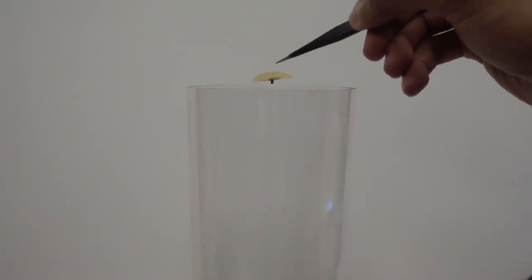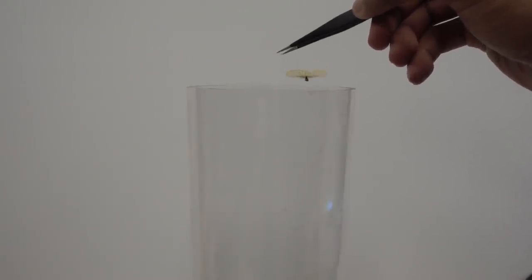We take inspiration from these dandelion seeds to build battery-free wireless sensors that can fly in the wind. Here we see one of these sensors hovering over a vertical wind tunnel. While some seeds flip repeatedly as they fall, dandelion seeds always fall in the same orientation. We emulate this structure to allow our sensors to flip over and slowly fall to the ground with the solar cells always facing up to harvest power.